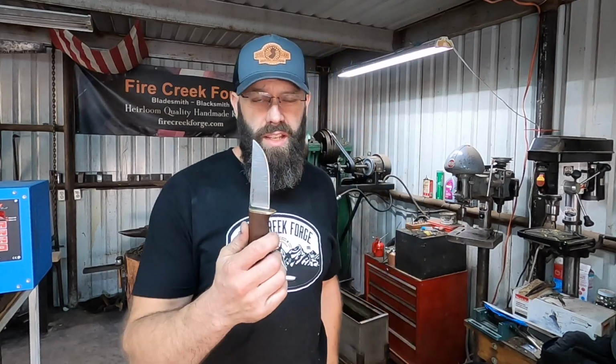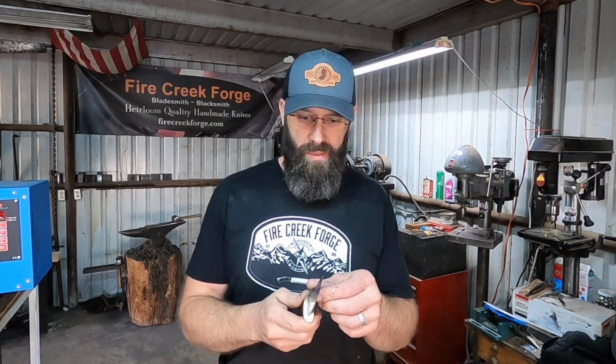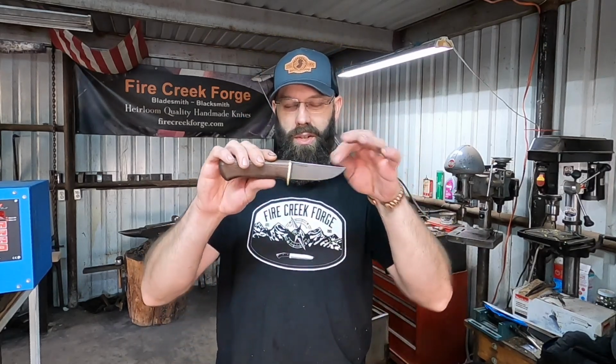Alright guys, well maybe the biggest takeaway from this video is going to be to be aware of decarb, which we all know about, right? But hey, that's a real example of how it can affect your finished product. So again, this is why we test stuff, this is why we figure stuff out before we just jump in. And I am excited to continue using this little blade here and keep putting it through the paces, but I am happy and excited to be able to give a positive initial, well, almost initial response to the steel and how it turned out with our heat treat.